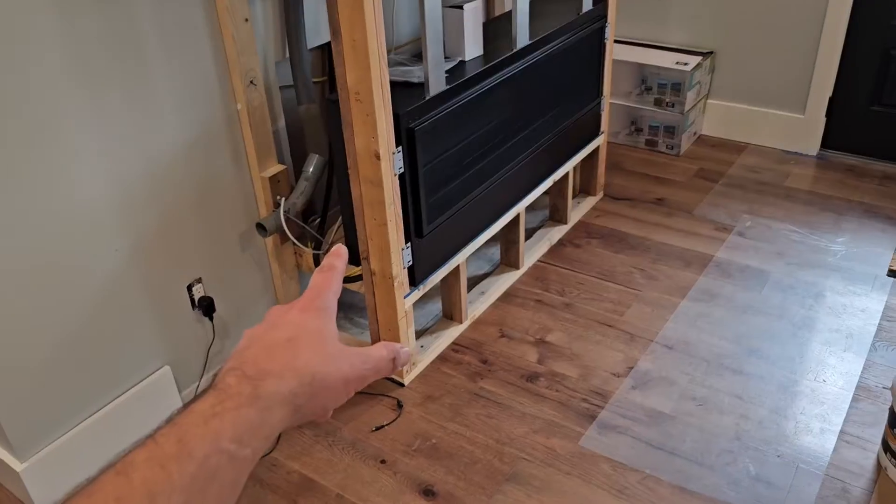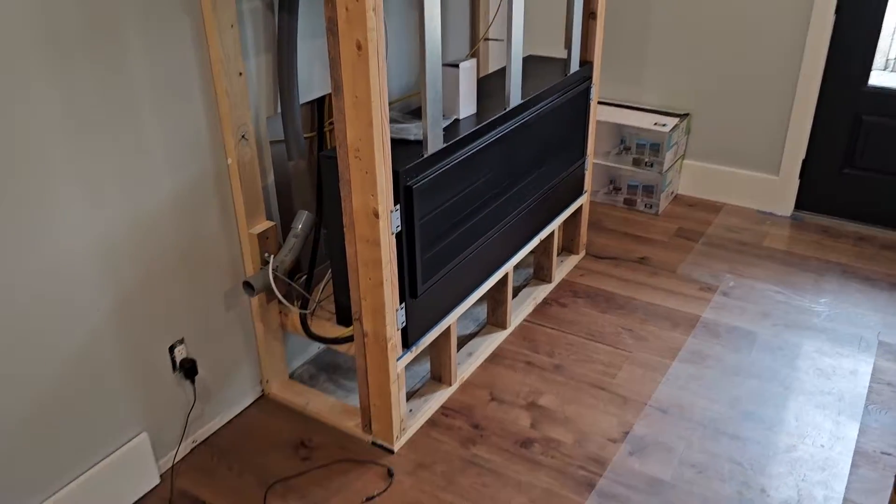If you want to learn exactly how much fresh air you need, there's a formula for that and I'm going to put a link to a website where you can calculate how much fresh air you need depending on how big your space is. This is a vent-free fireplace that's in the home. It's very important to have fresh air in a home where you have gas appliances like a vent-free gas fireplace or a vent-free gas heater on the wall, because these can release small amounts of carbon monoxide and deplete the oxygen in the home.